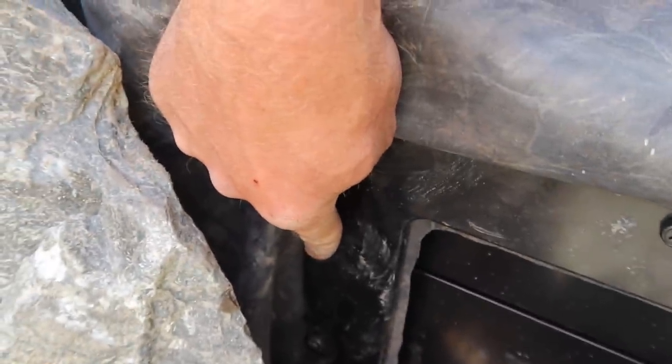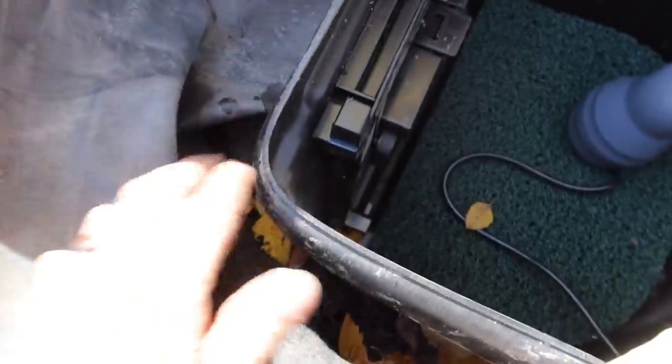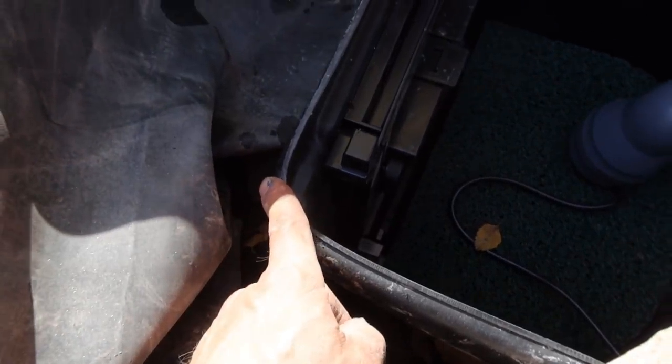Right there. That's what we establish water level as in our skimmer when we're setting the skimmer height and all that stuff, or when we're setting the skimmer. So it's easier for us to take the transit stick and actually rest it on top of this thumb screw that's set right at water level, rather than us trying to line up on the front side of the skimmer with those screw holes. And a big reason for that is the face of this skimmer sticks out about a half inch farther than that screw.